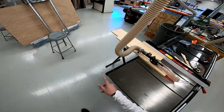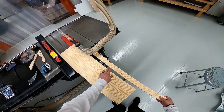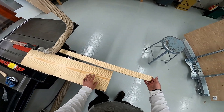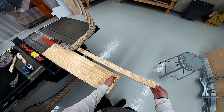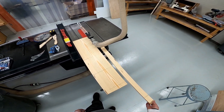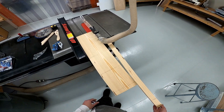That's it. You're going to use both of these boards for your project. We've got our two stretchers, and then we've got our top, our leg, and our other leg. This piece will be scrap, which actually makes for a really good sanding block — you might want to hold onto that. And then this will be scrapped; that'll just get cut away. So that's the rip cuts — you're done with rip cuts for now. The next step in the next video is going to be doing all of your cross cuts.